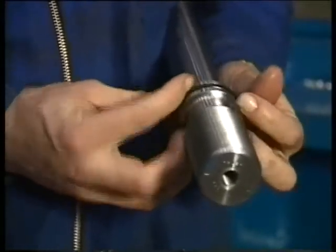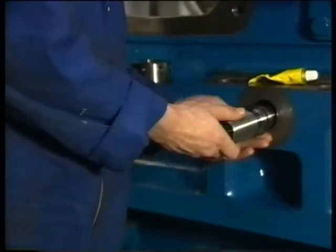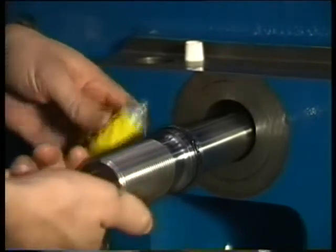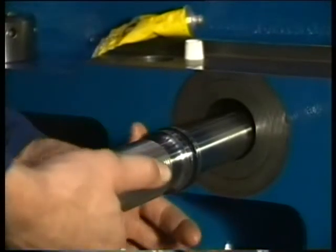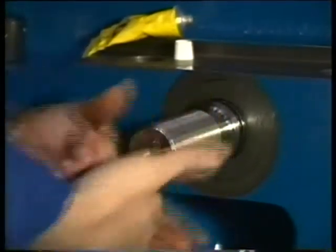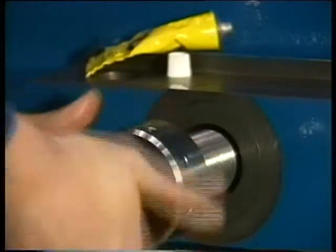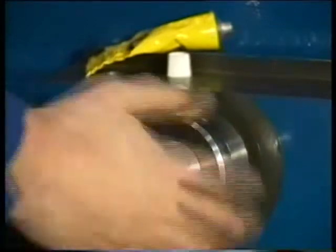Place new O-rings on both side studs and lubricate the O-rings with the prescribed grease. Now screw both studs into the bearing cap. Now slack off the stud a quarter of a turn. First provide the stud with a nut on the engine exhaust side only, because this stud is pre-tensioned first. This is done to align the bore of the main bearing.